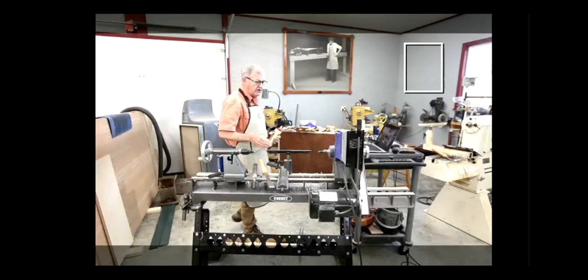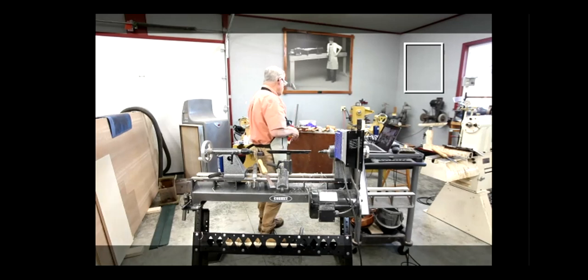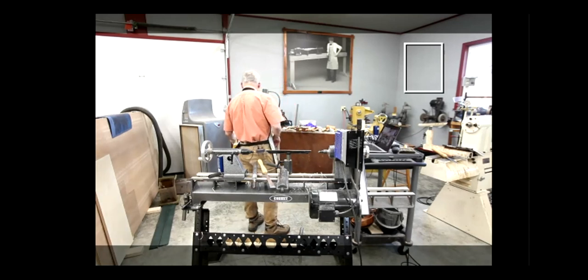Also, in this type of a repair in the shop, I would tend to use just a plain cold glue or even hide glue and simply let it dry long enough for the repair to really be stuck there. In that, I think the longevity of the repair may be better with these types of glue or hide glue than it is with cyanoacrylate. But it's sure fun to do demos with it because it dries so quickly.